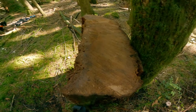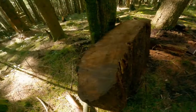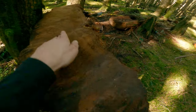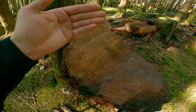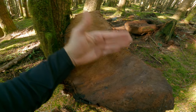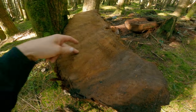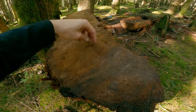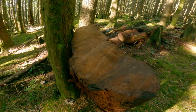Looking at this you can see the grain runs this way. When you make your slats you always want to go as perpendicular to the grain as you can, because when you split it, all the grain edges will give you traction. I'll show you when I cut it — in wet weather it's a lot more grippy.